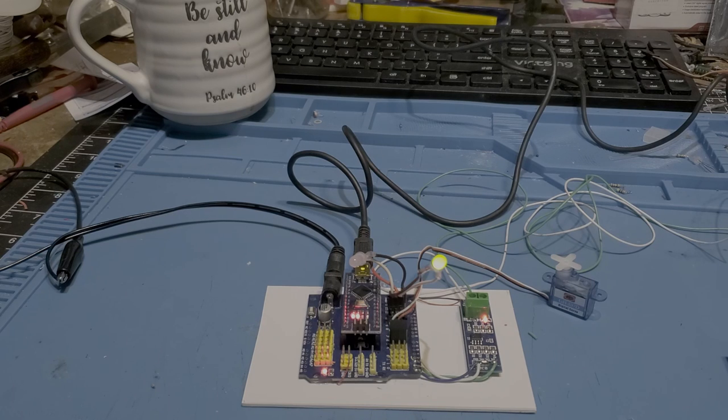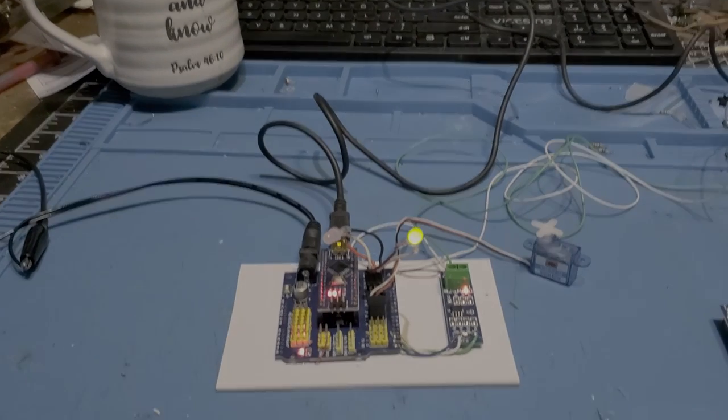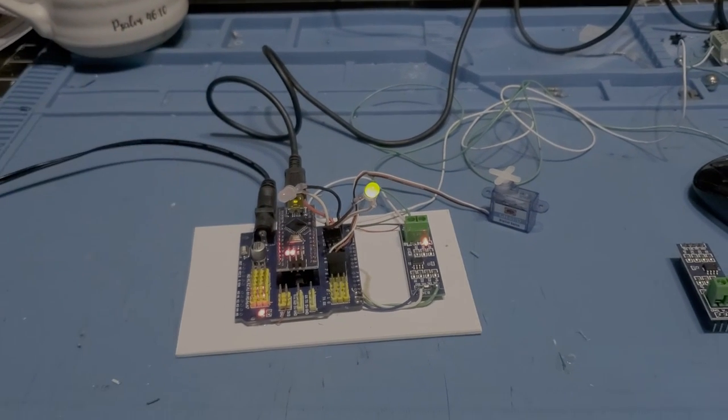As I promised on the last video, I'm going to go over the RS-485 hookup, and so you know, it's really, really simple. But I just wanted it out there so you guys know. I'm going to move the camera here to the RS-485 level adapter. It basically converts the RS-485 levels to 3 pins going to the Arduino. I will show you what it looks like in a picture up in the corner, and I will obviously put links to it in here.